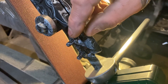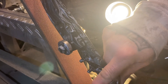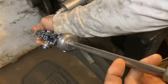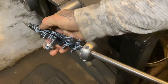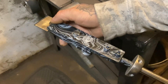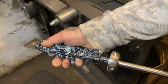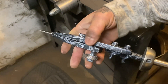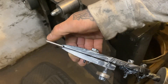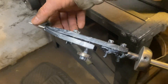As the knife gets thicker I have to add shims here, because through center this has to be centered with this rod at all times. The fatter your knife gets the more it's going to pull away, so you're going to have to shim it. I need to make a 0.3 millimeter shim — I have some aluminum but I'll use really thin nickel shims to get it exactly to 0.3, because you always want it perfectly in center. If it's off one way or another your sharpened edge is going to be off. That's how you make it perfect.